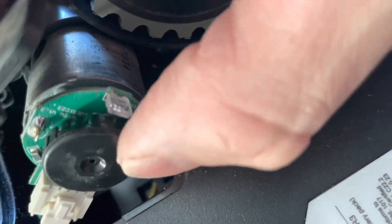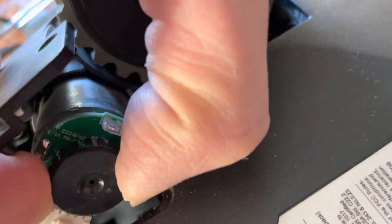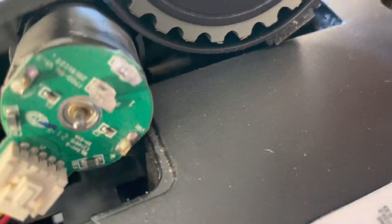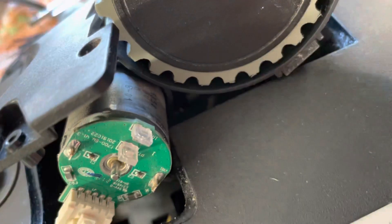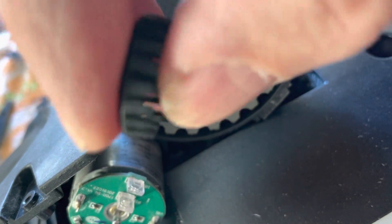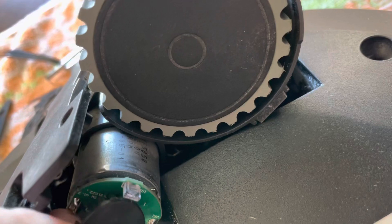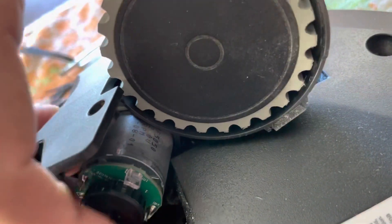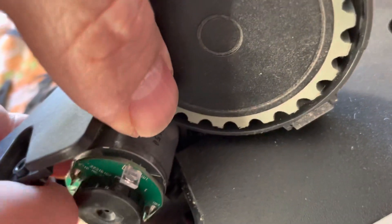Can you see this little wheel here? You can pull it off and you can see that there are two sensors. I believe one is lighting up and the other one is detecting light. The wheel that I took off looks a little bit like a gear, and as it rotates it will obstruct the light, allowing the sensor to detect how fast it's going. Probably there was some dust or something stuck in there, so I just blew on top and cleaned it properly.